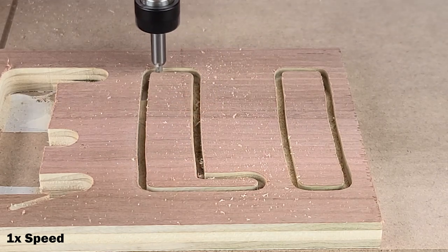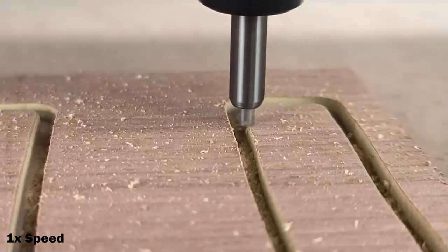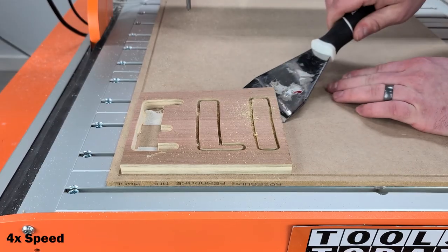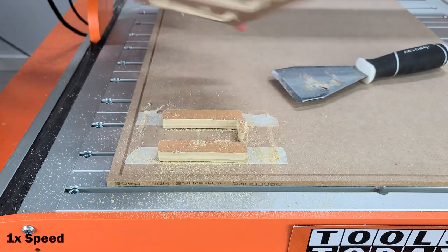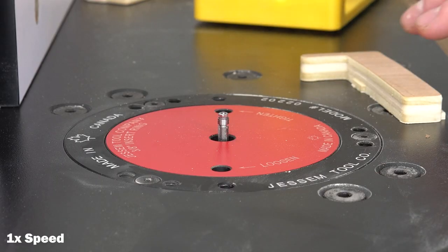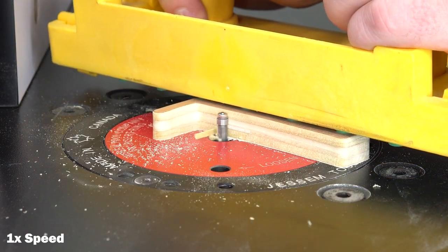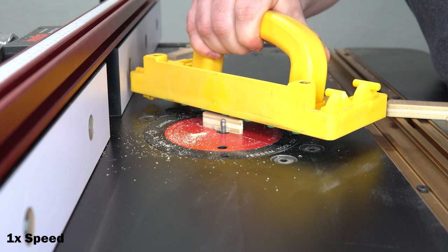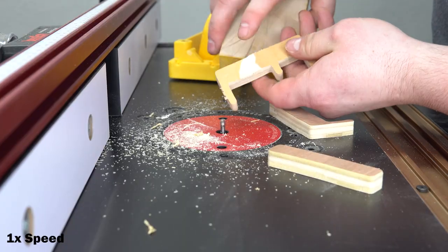We picked up the point round over bit and you can see it's just rounding over that edge. The autofocus kind of failed, but that's part of the process. These are both done, and one piece went flying about 10 feet from the CNC. Used the multi-tool again to get those tabs trimmed, and the other two letters are done. Moving over to the router table using the MR0102 mini round over bit — this bit has a 3/16 inch diameter bearing so even on an eighth inch bit cut it can get right into those corners, and it's a smaller diameter bit so it's less likely to grab your piece.